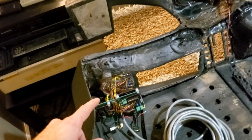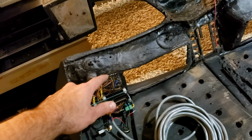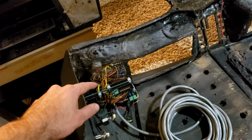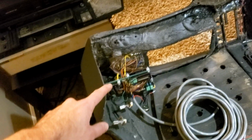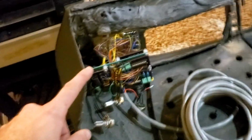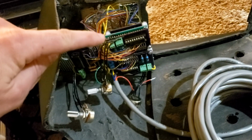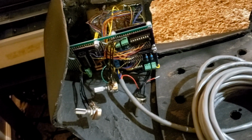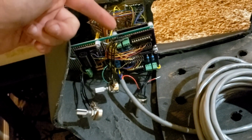Right now I don't have this backboard mounted in here. This is all connected as one unit, and we've got this panel just sitting in place. This will be mounted back here as well, and we'll clean up the wiring just a little bit, but all these are hand wire wrapped. It was my first time doing wire wrapping ever, but it's actually pretty easy. I did break my rule a little bit, and I designed and had fabricated these custom boards. Each one of these tiny custom boards is a bar graph driver that allows you to adjust the sensitivity of the bar graph. So I did kind of cheat there. I did 1, 2, 3, and then there's a 4th one right here on the back, and that controls the 4 directions of the compass.